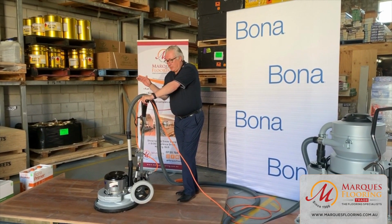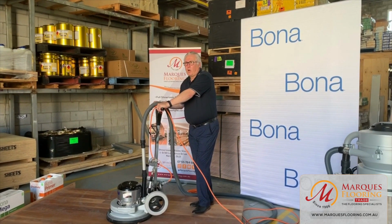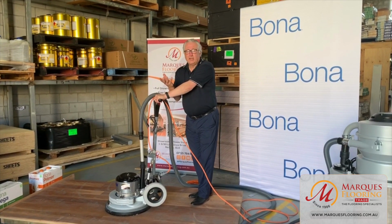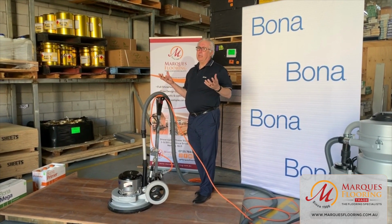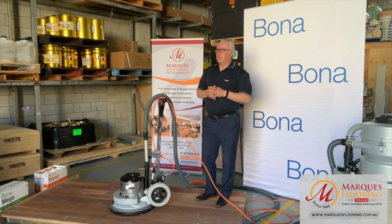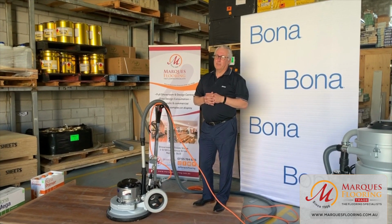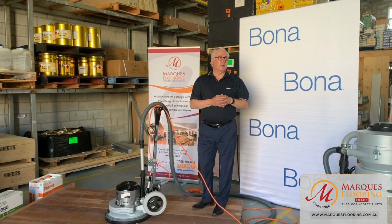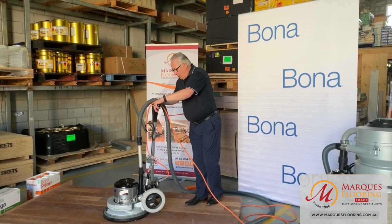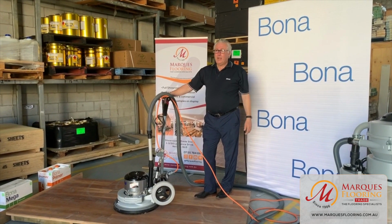There are a number of attachments that can be fitted to this machine, including concrete grinding attachment, wire brush, and systems like the Quattro base, which is just a 4-head, no gear system for other applications. Perhaps even if you were considering sanding a pre-finished floor for overcoating, the Powerdrive would probably be a bit too powerful in that situation. So we're talking about a machine here that is 50 kilograms in weight.